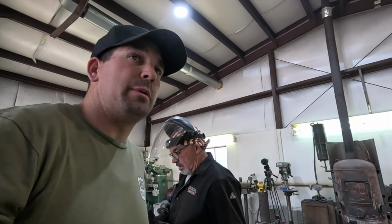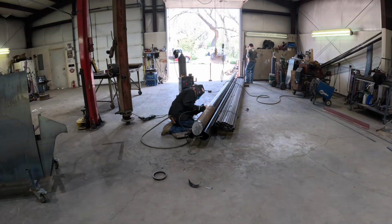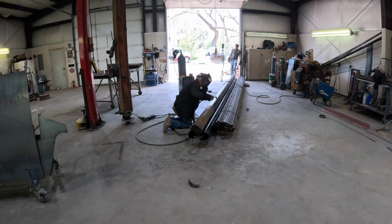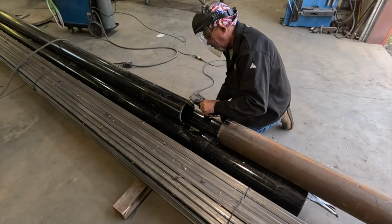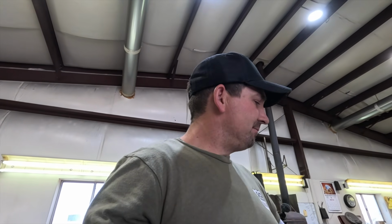Sweet. Here's the top hinges. The pipe is welded to the gates, which you saw on our little flashback, but those will weld right on, and it'll be permanent till somebody runs into it and breaks it off. That paint doesn't weld very good. No, for some reason you can't ground through it or weld through it. This side looks good. Got 2 passes around it. He welds and I'll spin it. It's working out pretty good.